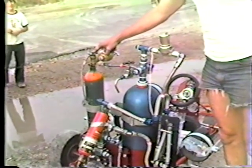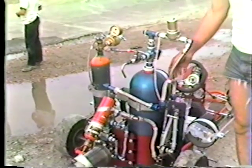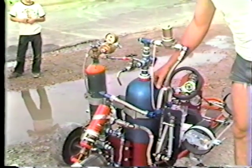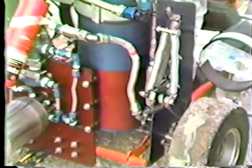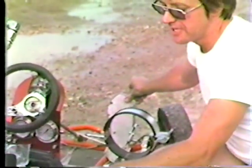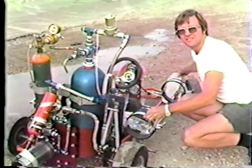What you basically have here is a fuel tank, which is pressurized by this nitrogen. Your regulator here drops it down to about 600, which pressurizes this tank. It has a siphon pickup, so there's about three gallons in there. Is that your fuel cell there? Yes. Then it comes up through this long tube, goes through this precision filter here, and then it goes down here into a ball valve. That's your throttle valve down there. Now if you notice the operation of these valves — when you pull a valve open, you get oxygen. This is your large one, oxygen flow. You pull that open, you get oxygen flow, and then as you pull it further, the fuel comes on.